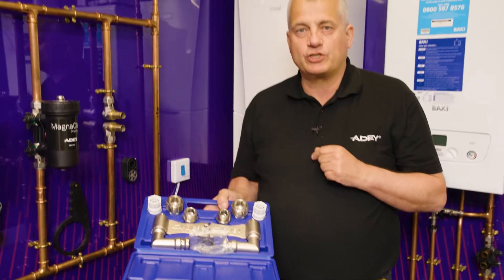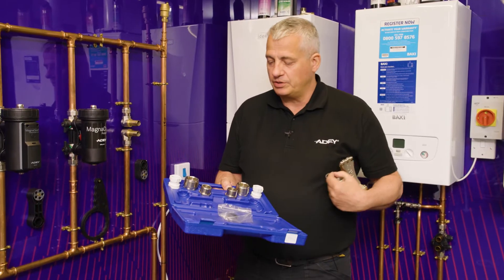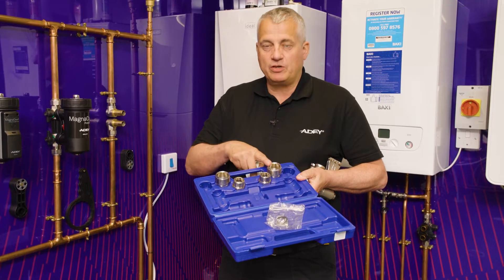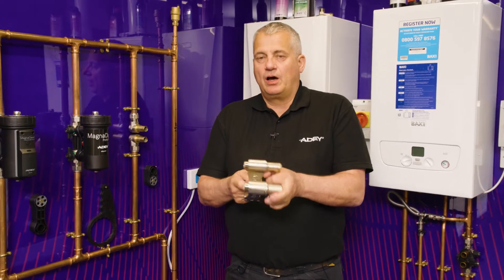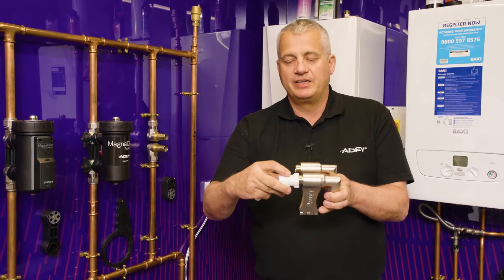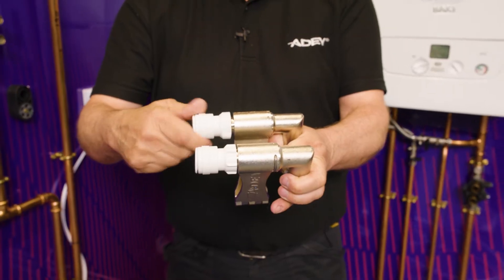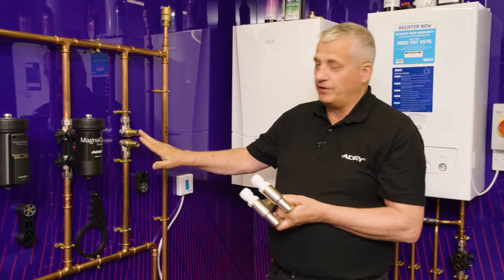On this occasion, for our Professional 2 or Micro 2, we are going to need the plate and the two push-fit fittings. The other adapters will be used for the 28mm or our 2XP. On the end of our HTV bracket we have three-quarter threads. Our John Guest fittings will screw nice and easily onto the end — pinch them up firmly.